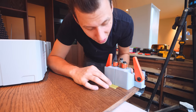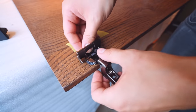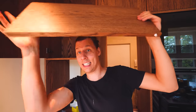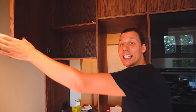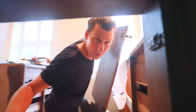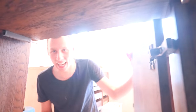One tool I'm not going to attempt making myself is this — it's the tool that makes the holes for the other end of the cabinet door hinges. Just like that, the hinges snap in place, click down, and you've got perfect hinges every time. And then to open the thing — this is the shelf — I drilled a hole into the edge and inserted one of these push-open pins. So now we've got a cabinet door that is push-open just like everything else. For the corner storage, I've already pre-assembled everything in the workshop, so all the pieces just click in place. We just need a door, and the push-up mechanism is attached separately to the top. Pretty neat, huh?